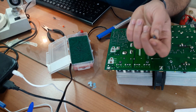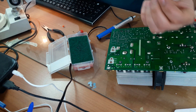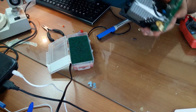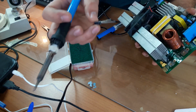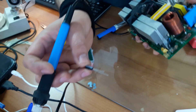It's out. Use a good replacement capacitor with the same value, always. Of course before we put it in, we need to check the polarity, and if you are familiar with electronics you will know that in this kind of electrolytic capacitor there is a polarity.